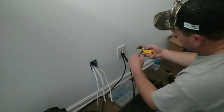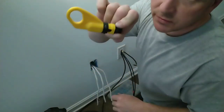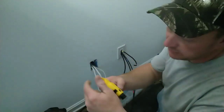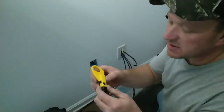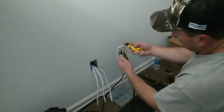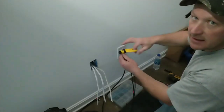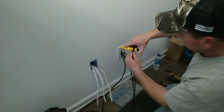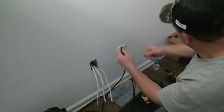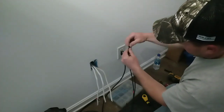strip this out. If you've ever seen one of these, this is a Klein Tools RG6 stripper. They have them for different sizes. This one I believe will do RG59, RG6, and RG6 quad. It's fairly easy to use. Slip the blade in, like so, until it marries up flush on the backside. Spin it around, push the button, pull the tool off, give a little twist, pull your grounding wires, your static ground back down,